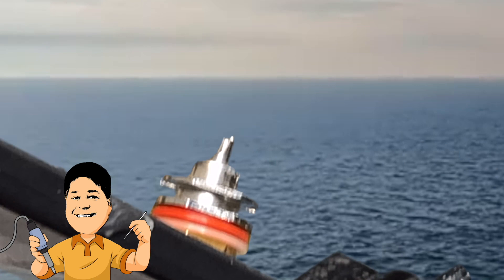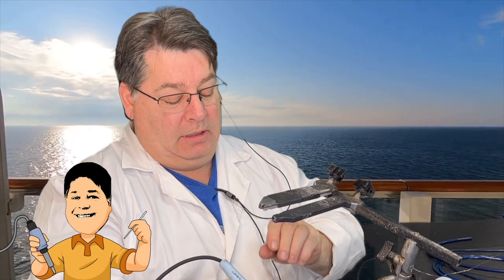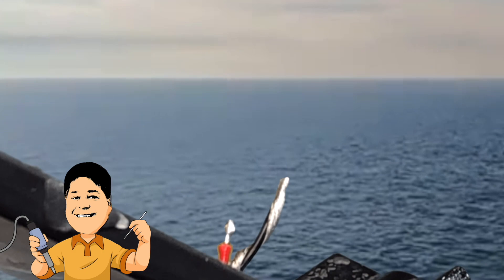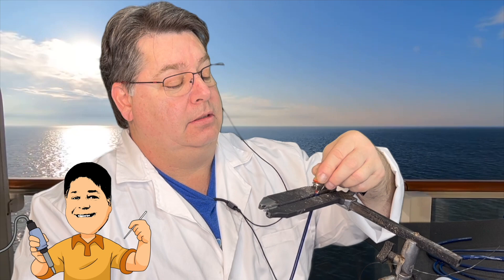You can see the little solder cup there — it's just upside down. I'm gonna put a little pre-soldering in there just a little bit. Just like that, tape it out, wire it back in, put it on the right side for the positive, and then hold it up against there, and then put your tip right at the end — boom, done. And then it'll just stay there.